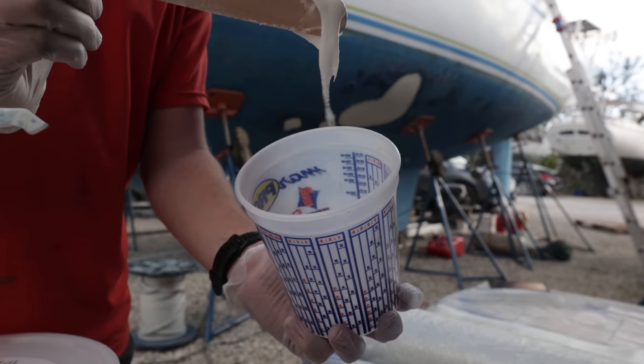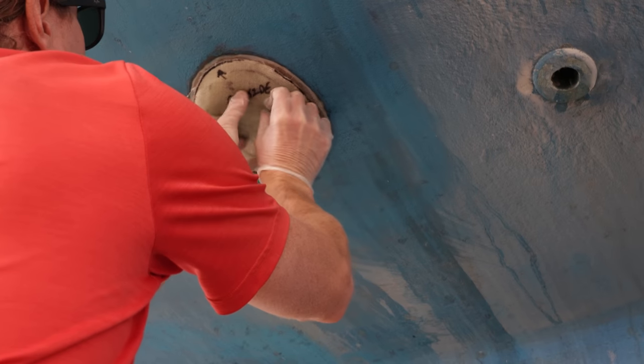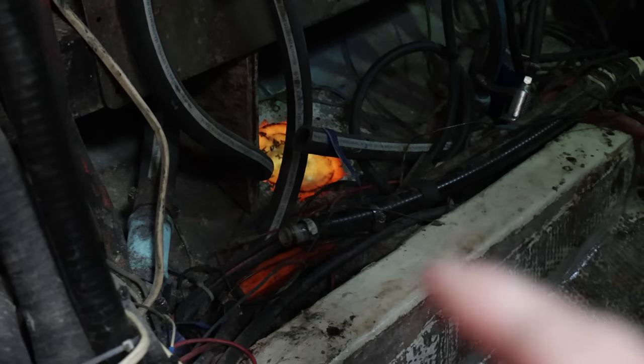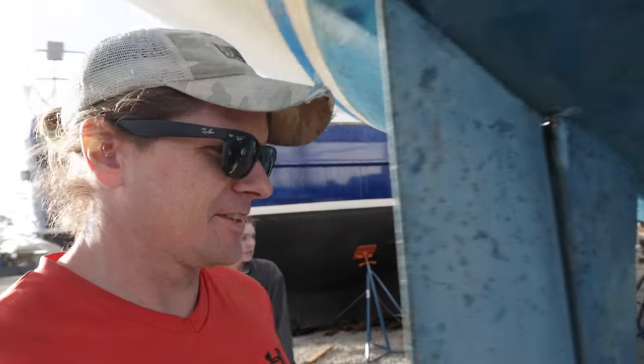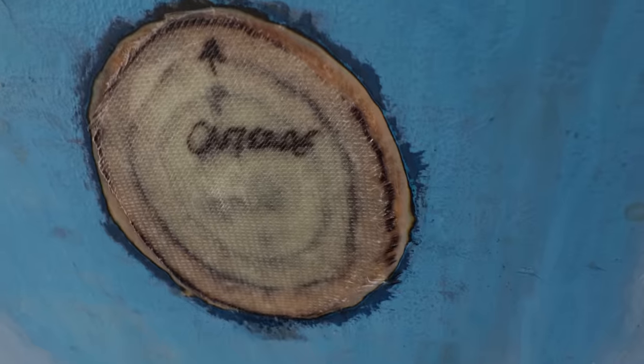End of the work day — it's been very productive. This is thickened epoxy, filling in some voids so that when we lay the new glass box it adheres better, and we have the interior pieces laid. Kirsten has been working on our super secret project that we'll show you in a future video. We've got four layers of exterior glass laid, so probably two more layers tomorrow to get it up to the depth. Hopefully we get less finishing work on this than the big one because we're more practiced — we're basically professional fiberglass layers now.